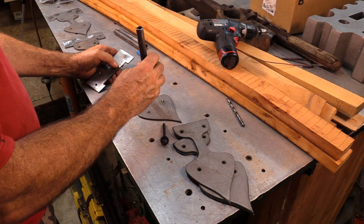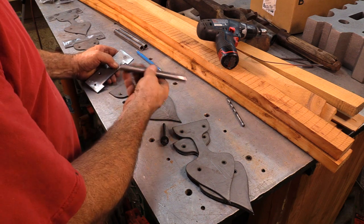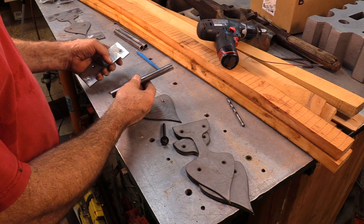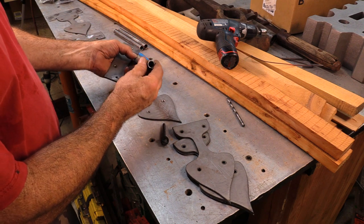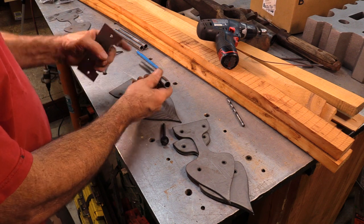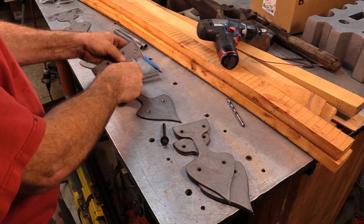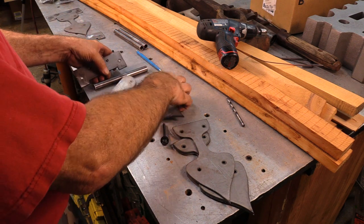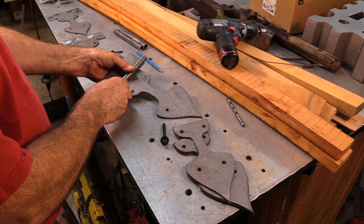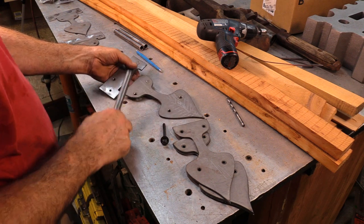And then what I have here was a piece of steel tubing I have. It was a handle for a like an air pump pickup little crane thing. Anyway, I took the handle and I've reamed this out to 1/2 inch to get rid of the weld seam. And then I'm going to make some pins. We'll cut this up so that we have a 1-inch piece and a 1-inch piece here, then this piece in the center. So that will be welded in like so. And this will be on the inside as the hinge.